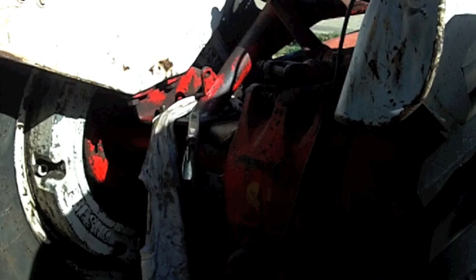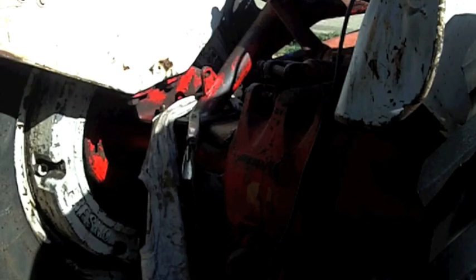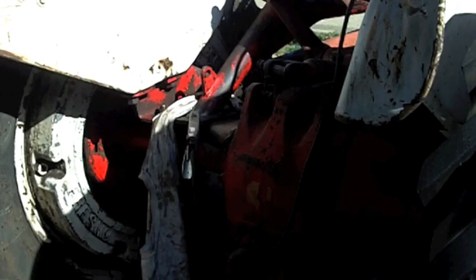This one was at 15 or so. They're water filled. Look at all the water that piddled down there because I overfilled that one. Had to drain some of it out. And the front ones were at like 60 psi. They're supposed to run about 40. Are we gonna need to drain those? I don't know, dude. We'll have to figure out something. Well, if they freeze, they'll just swell the tires a little bit. Or put antifreeze in it. Alcohol or antifreeze would work. Go to the dollar store and get some, whatever.